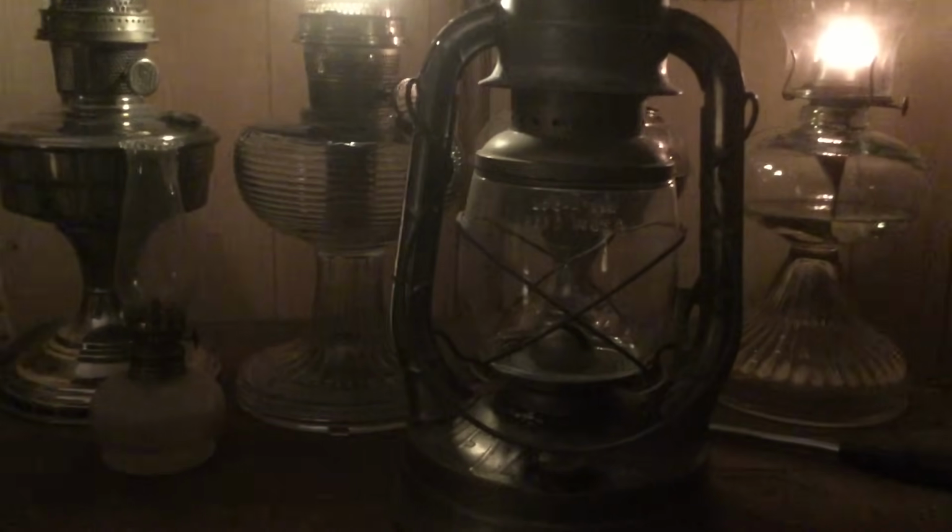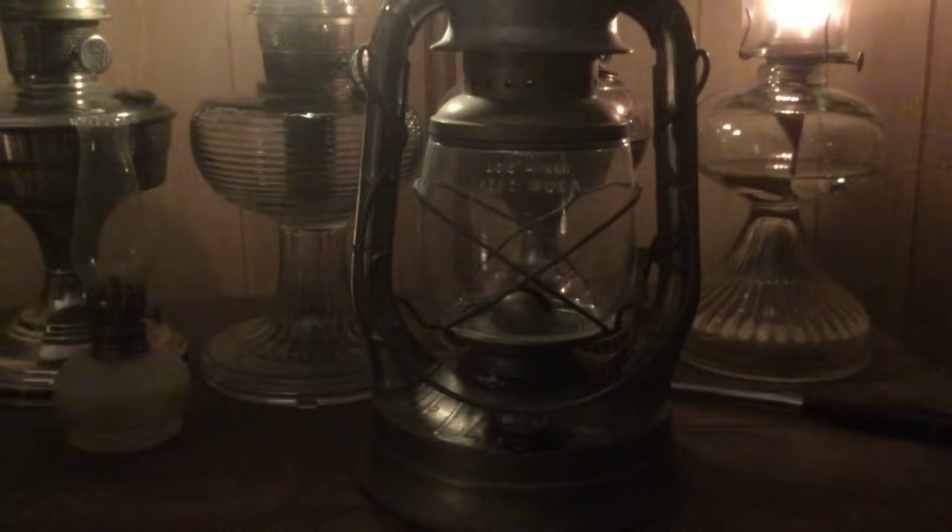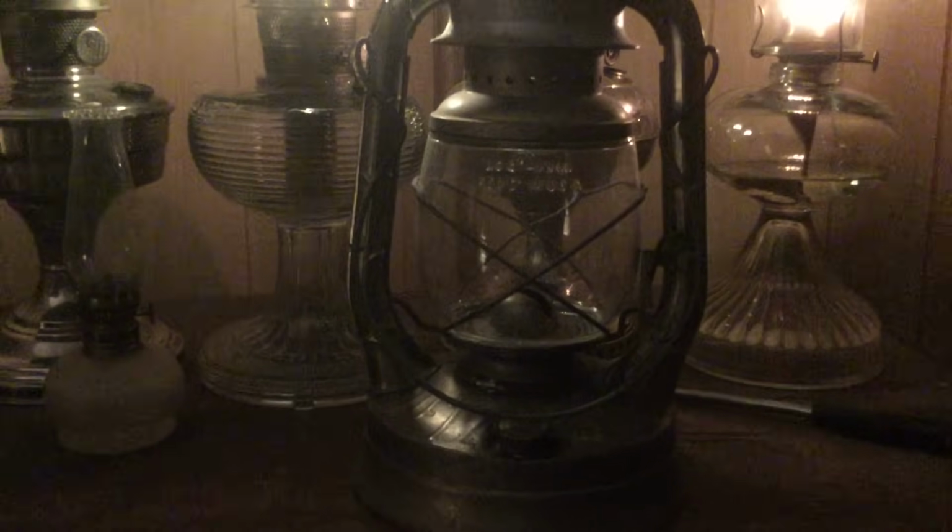and down, and then there's a two-layer cavity in this part here, and the air drawn into this tube is drawn into the burner and up, and then the air heated by the flame rises up. Also creates a bit of suction to draw air in through these holes here. A little bit of air might be drawn in through there, and then most of the air exits out here at the top. This is a feature that was patented in the mid-19th century, because it was discovered that rather than just having a flame protected by a simple enclosure to prevent the wind from getting at it, the cold blast would actually make the flame brighter than just a simple protected flame.